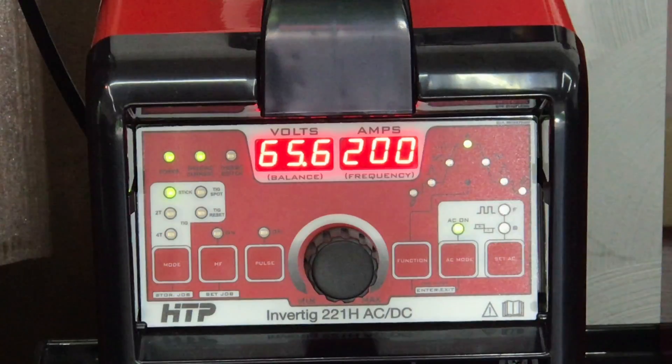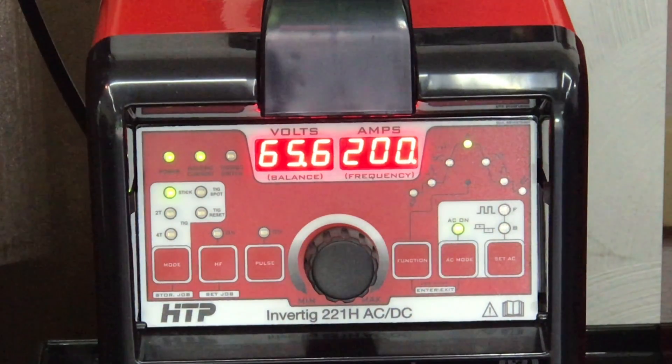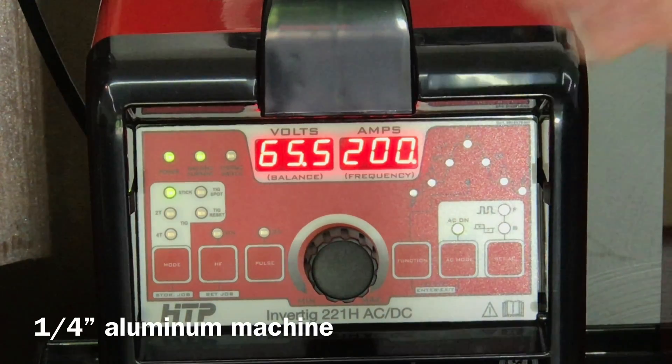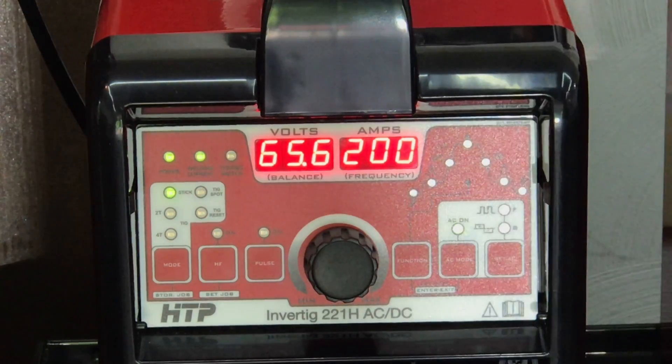That's a tip for those who end up in VRD mode and don't understand why. If you have any questions about the amplitude setting, shoot a message in the comments - I'll help you out. It's very easy to use once you start figuring it out. Do some test pieces with it, you're gonna love it. This is a quarter inch machine, but with the amplitude settings you can get a lot more penetration out of it. Thanks for watching - if you want to see the next video using the Invertig with these AC amplitude settings, click subscribe and like.